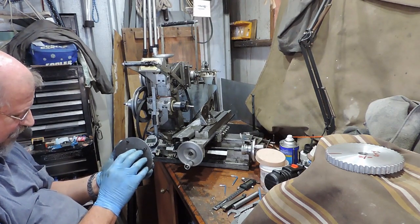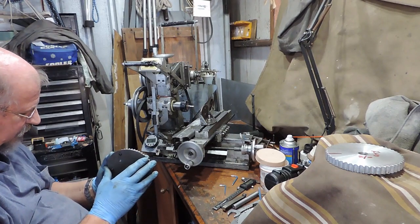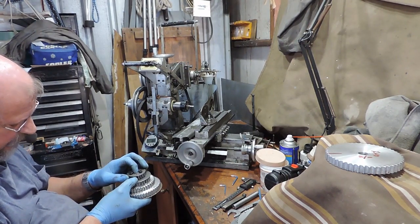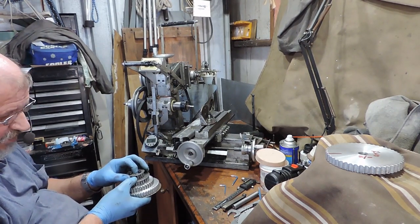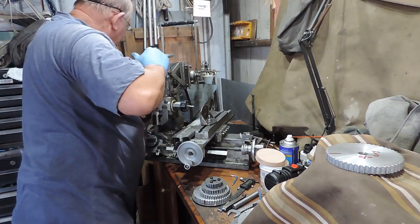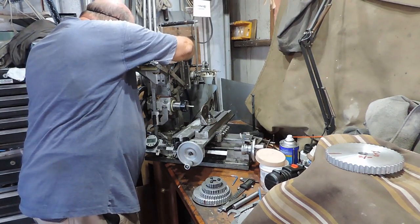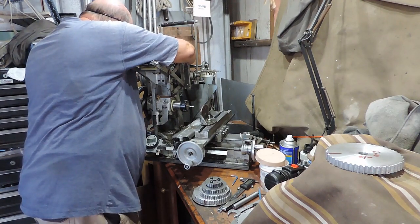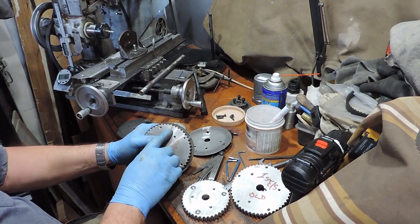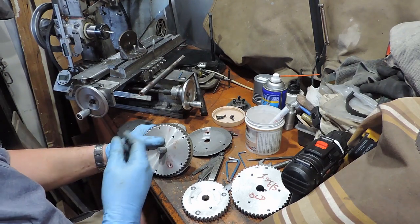If this is in the wrong place and I just put it on without thinking about clocking it, it could be anywhere wrong. What I will do is — the grub screw bears down on a flat spot in the countershaft — I'll just file a new flat spot and that will fix it. I've got to get this countershaft down so I can check its position, and of course it doesn't want to come out. I set a punch mark on all of the plates and the pulleys — that's how it all bolts back together again.